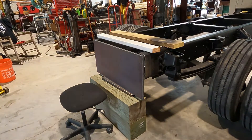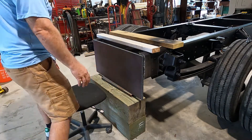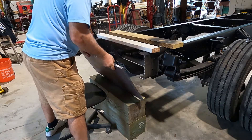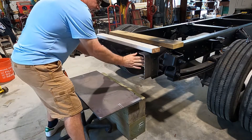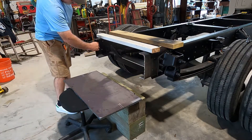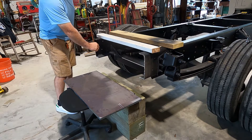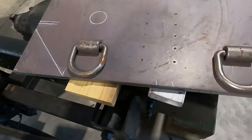I'm cleaning the lens here — that's better. I've got a hitch plate here, just leaning up against there. I've gone ahead and marked the areas where I have to cut it out so it can slide in. I'm going to set it in from the edge of the frame at about a quarter of an inch, that way I can put a nice steady bead around it.